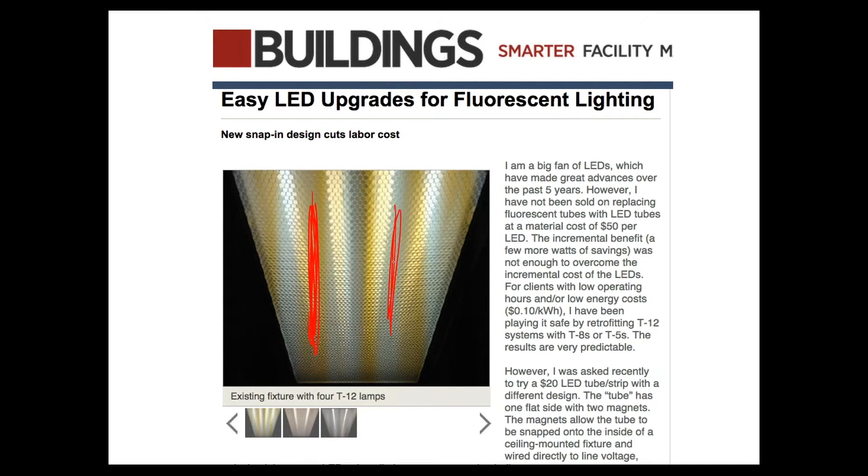What you do after that is install these LED light wands. The incoming power connects to one end of these — it's an LED strip that magnetically sticks into the back of the fixture. Then you have a little jumper whip wire that connects one to the other LED wand, and you can connect about 20 of these together in a daisy chain fashion. Two LED wands will basically replace four T12 or T8 lamps.